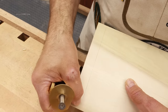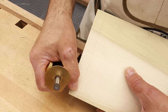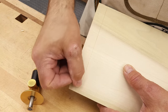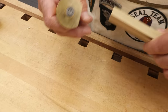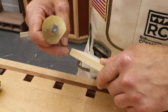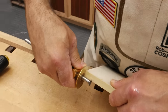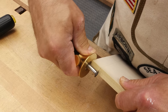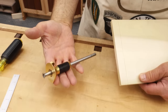What's been cut is going to be square on this side — the bevel's on this side. So as you remove the material and then go to join something against that line, you're going to get a nice, tight fit. Now, when it comes to doing the edges, there's not a lot of reference surface here to run the tool across. So what I sometimes do is just roll it — a couple of times if you need to — and you get a nice, clean line on there as well. Then go all the way around. Real easy.